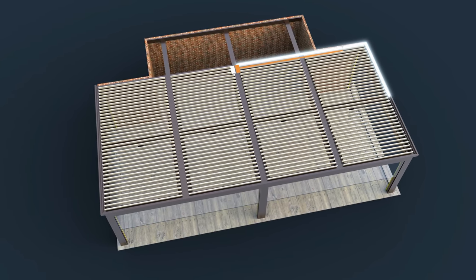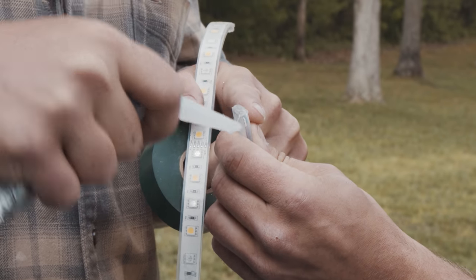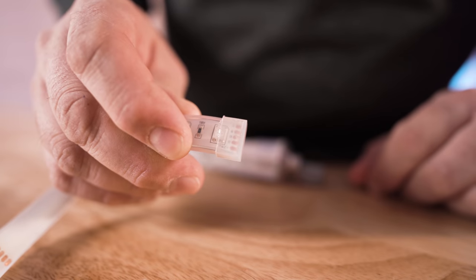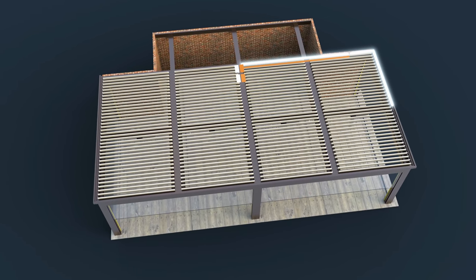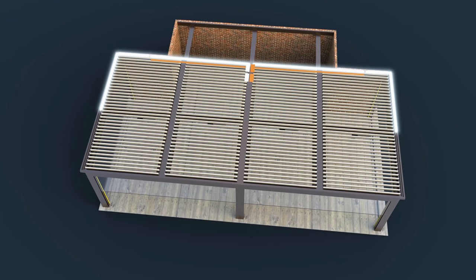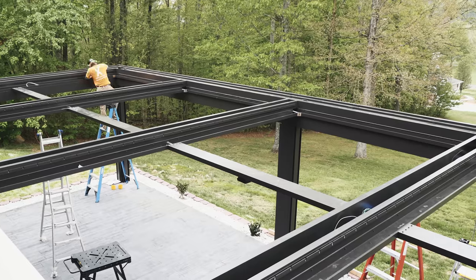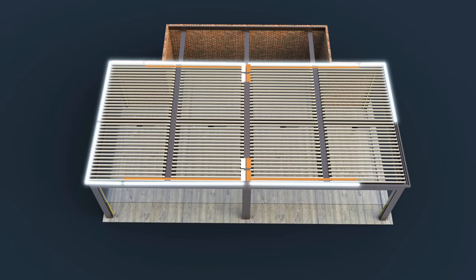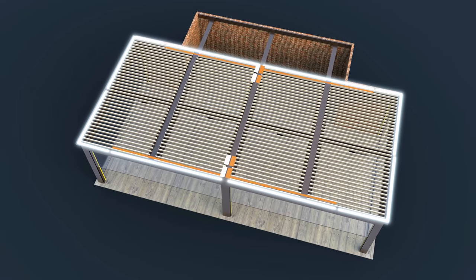Now that we're laying out this second reel of lights, you'll notice that we didn't use the full 16 feet. We chose to make it simple — just cut off the end of the strip light and seal it with RTV silicone and an end cap. Now that we have the first quadrant laid out, we can lay a second power supply and controller into the beam chase. We're going to lay out the reel and then add extension wires to get the second part because it's longer than one reel length, just like we did in the first quadrant. Once you do that, we have half of the gutter wired up. We're going to mirror it over on the other side and just add two power supplies, two controllers, and four more strips. And now we have the entire gutter illuminated with strip lights.